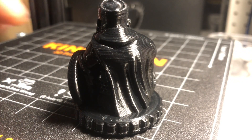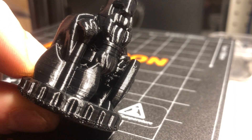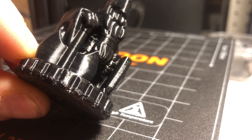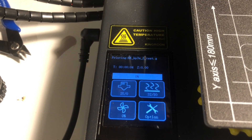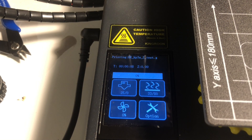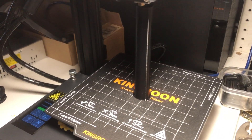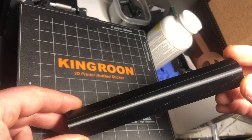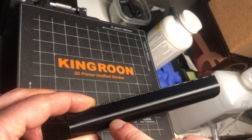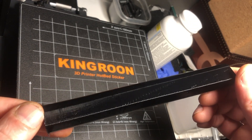After getting the figurine printed, it looked pretty decent, but you can see some kind of consistency problem — extrusion or layer height issues, some problem with the Z-axis. To diagnose it I made a Z-test: basically a rectangle with two adjacent corners rounded off, printed at low speed to isolate mechanical issues. That lets you see Z-axis wobble, banding from over-extrusion, and any cyclical or random trends. It looked less like a definite Z wobble and more like a Z inconsistency problem combined with some random extrusion issues.